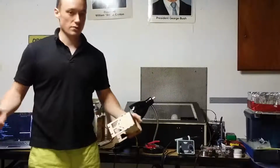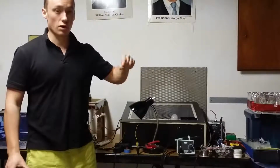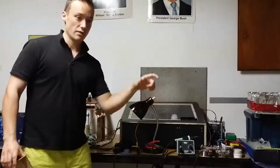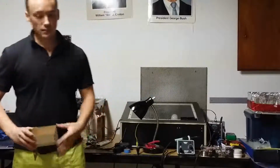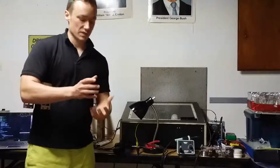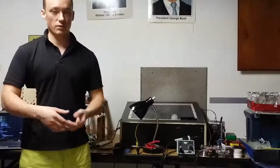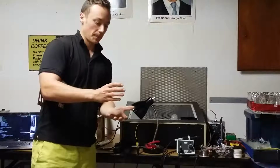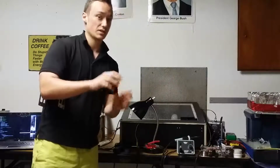So, for instance, if you wanted to 3D print a metal cube, your layer would look like a square because it's a cross section. You make a square, you move it down, another square gets put on top of it, and the process keeps going. And at the end of the day, there's a cylinder filled with metal powder. Because unlike the 3D plastic printer like a MakerBot, I think it's FDM, not too sure, there's material left over. It's a cylinder, fully filled no matter what, it's always going to be fully filled with metal powder, except some of that happens to be stuck together.